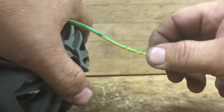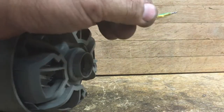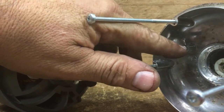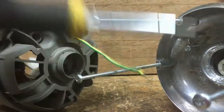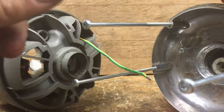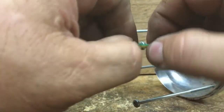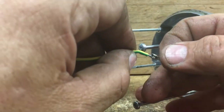Get that little nut — where'd it go? There it is. Back in there. Now what we're going to do is take this wire. I'm sorry if I blocked the view; I was too busy looking at what I was doing. You got the gist of it. See that little terminal right there — I'm going to have to take that off so I can crimp it; you can't grip it like that. I'm going to get a screwdriver. See how that's kind of frayed — you've got to make sure you get it really good, and as you're twisting it you're also pulling it forward so it doesn't bunch.